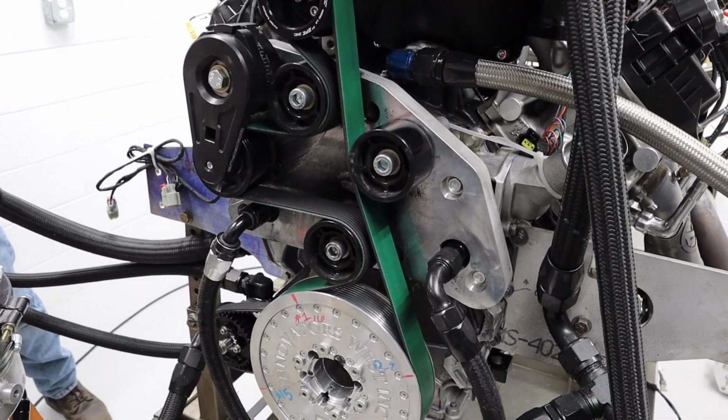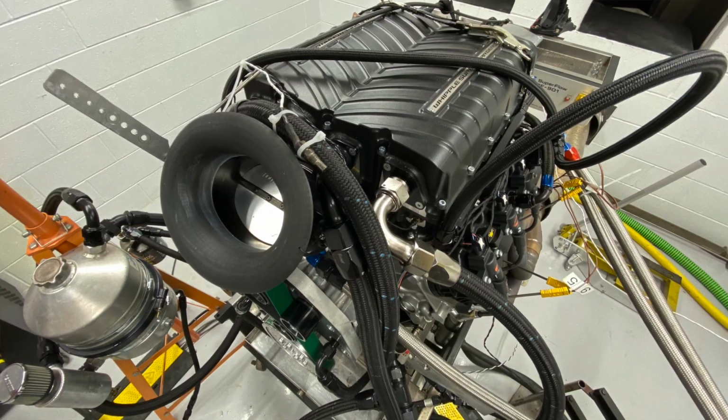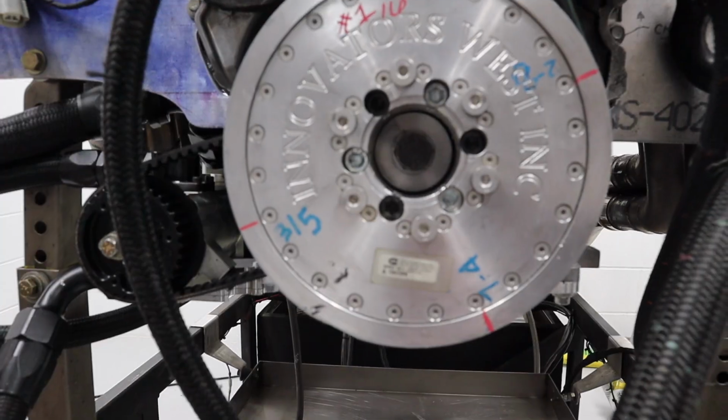We were only at about 16.5 pounds of boost. Okay. So we do need to get more boost. The class we want to run in and be competitive in is Ultra Street, and we're going to push closer to 1,700 plus, and that might take the 3.8-liter blower.